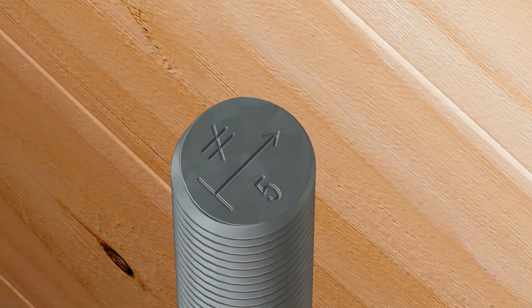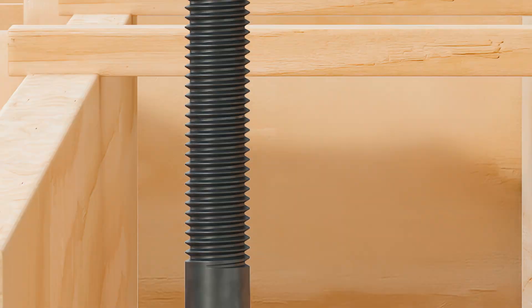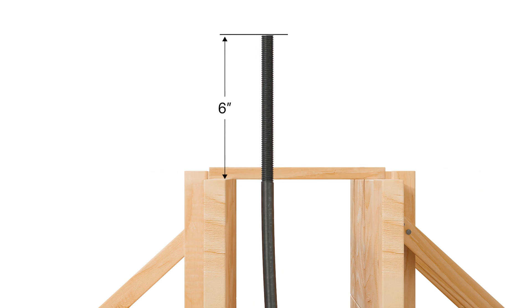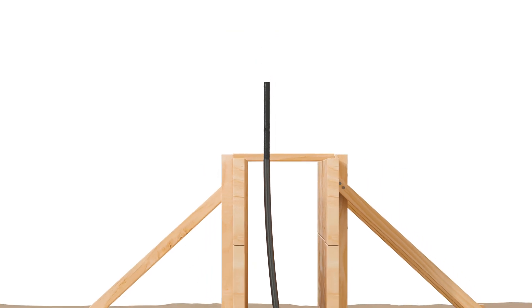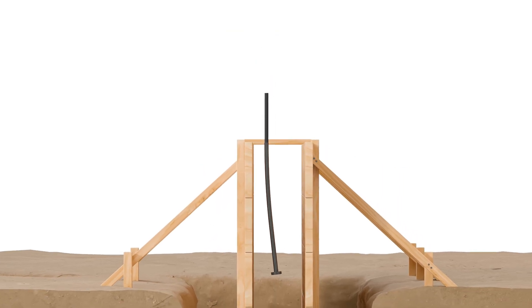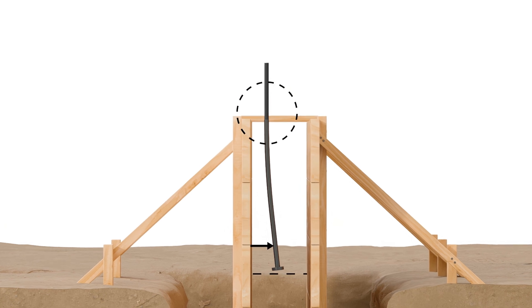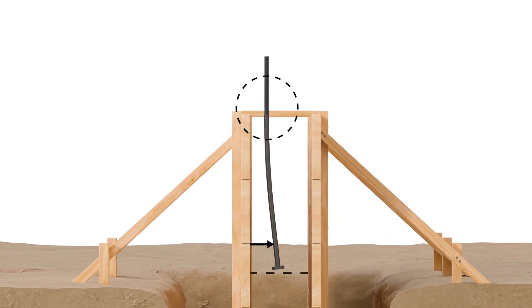The embedment line of the SABR is at the bottom of the threads. This ensures that the SABR has the required 6-inch projection above the concrete. Only the threads should be projected above the top of the concrete. Verify that the edge distance, alignment, and embedment depth of the SABR are in accordance with the construction plans.